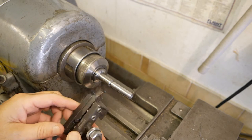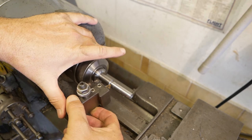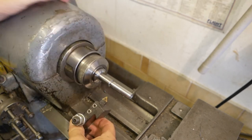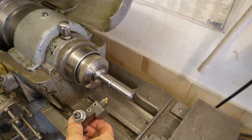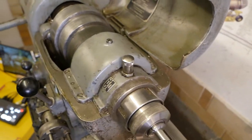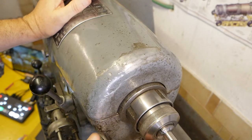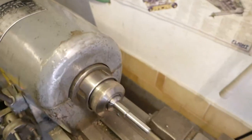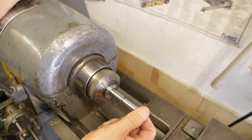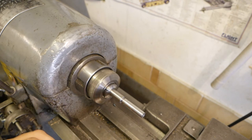It's dragged as it came in, it hit the collet and then dragged this in, diving it into the work until it ground to a halt, because one of the really nice things about a belt-driven lathe, the belt slips. So luckily you don't get anything like the really destructive crashes that you get on a more powerful machine or a gear driven machine. So I guess I can just whip this off and start again with a different tool holder, different insert. Okay, let me just grab the hacksaw. I'll just chop that off with a hacksaw. There's not much left of it.